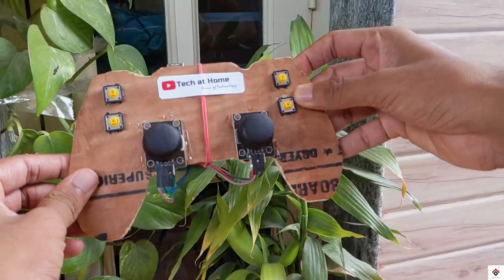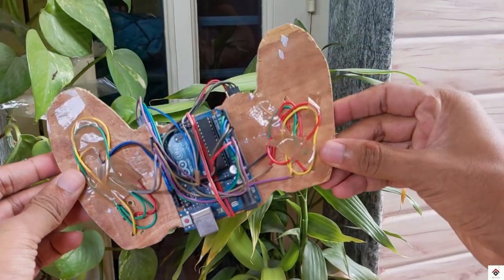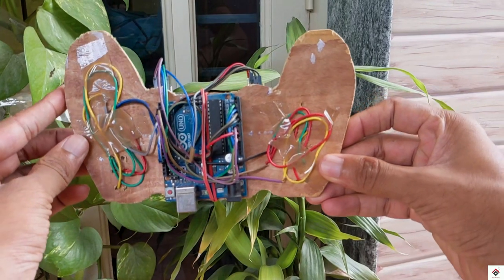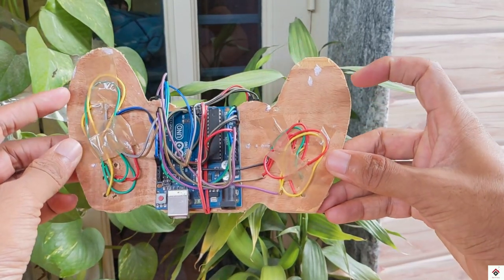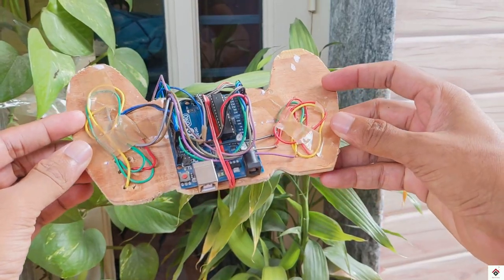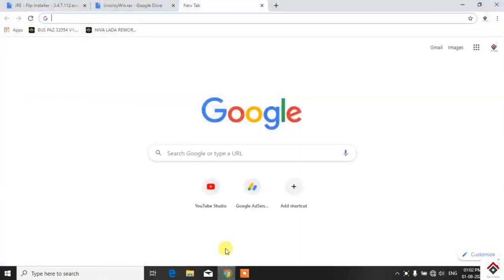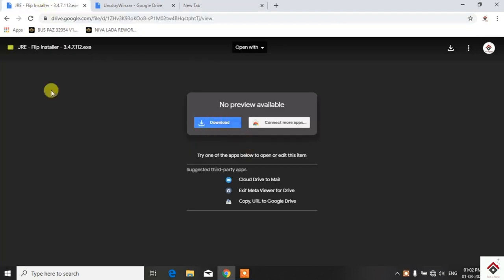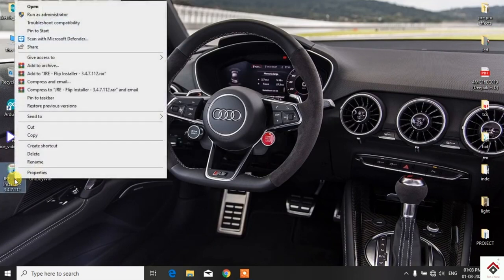Moving on to the software, first we have to change the firmware of this 16U2 chip so that it is detected as a joystick. So we have to follow some steps carefully. First, download and install JRE Flip Installer. The link is given in the description box. So here is a downloaded file. Just double click to install.